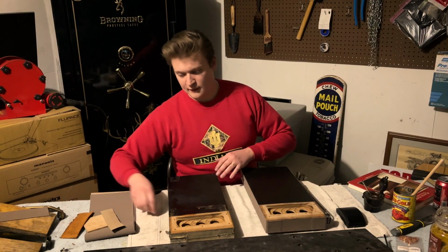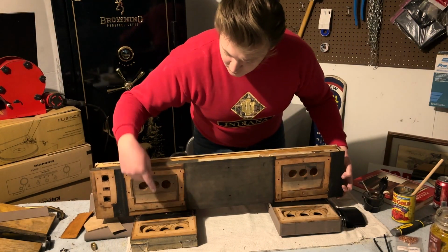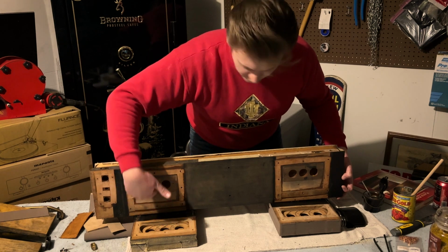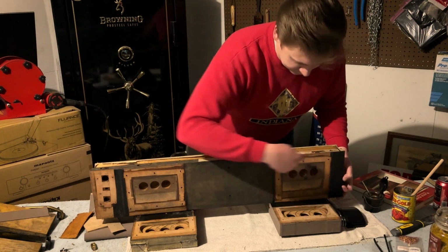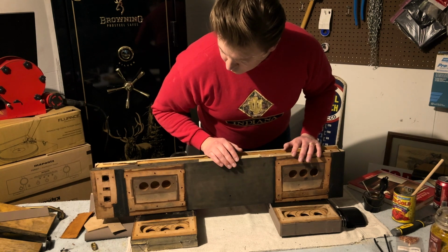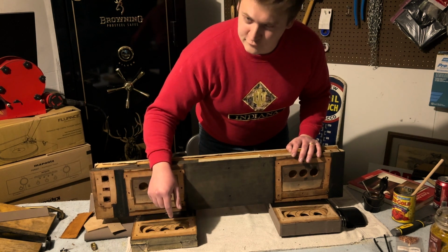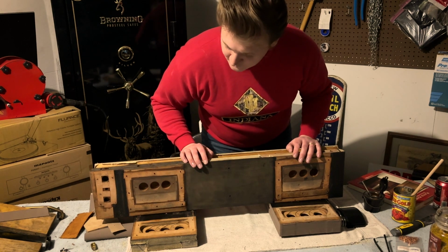I'll show you a little bit about how they go back together with the reservoir. They will screw back into the backside of the reservoir here. There are 8 screws in a 3x3 square minus the middle. And the same thing here, I will need to remake leather gaskets just as they were in the original to ensure that it is perfectly airtight. And I think that I will, at some later point, make another video specifically about how these screw together, because it made a fool of me. I think that's all I'll say about it for now, but it's really interesting.